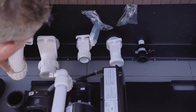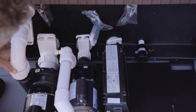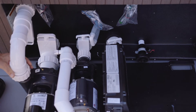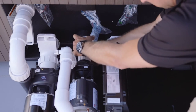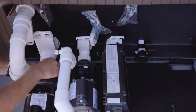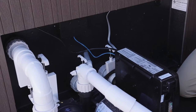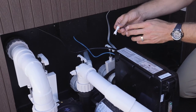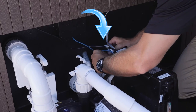Once all the connections are on, slowly move the management system to the tub. Move it close, then start hooking it up with the gaskets — remembering, if it doesn't fit, it doesn't belong. If you have a ClearTech UVC unit, attach that first: loosen the UVC mount, then attach. Then attach the heater and pumps and hand tighten the connections as tight as possible. Open the knife valves and install the clips. You always start from the middle out.